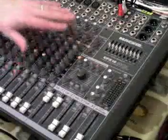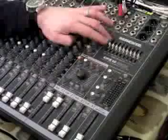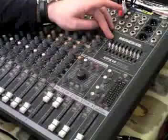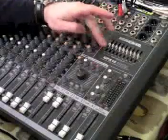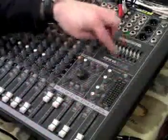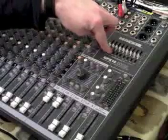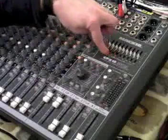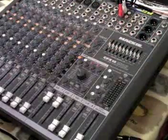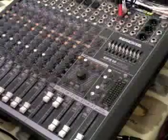So it's a little bit more detailed than the separate channel EQs, and a lot more choice on frequency ranges that you can either cut or boost, but the level of that cut or boost is exactly the same as here. It's plus 15 boost to a minus 15 decibel cut on each of these 9 frequency bands. So here at the lower end you have the sub 1K frequencies, particularly these first two or three, your bass frequencies, and then you get further and higher up the frequency range till you get to the very top end or trebly frequencies, up at 16k, 16,000 hertz, 16 kilohertz, those sorts of frequencies. So you can make fine tunings to the overall sound adjustment with the 9-band EQ.